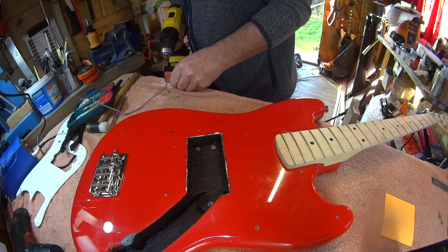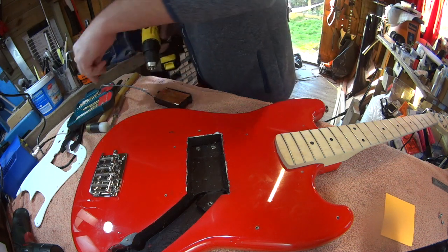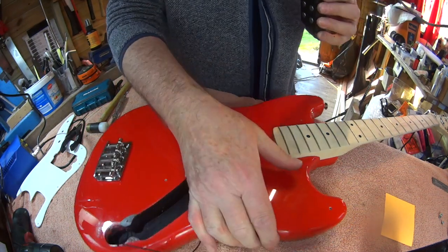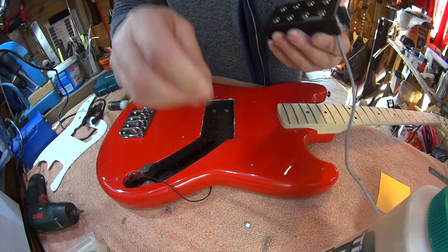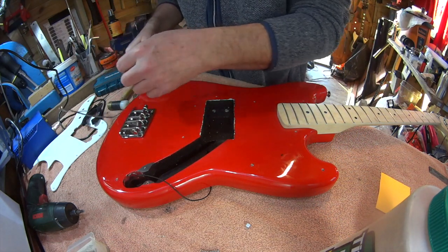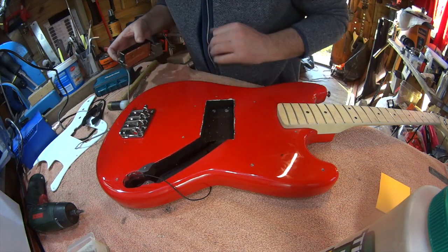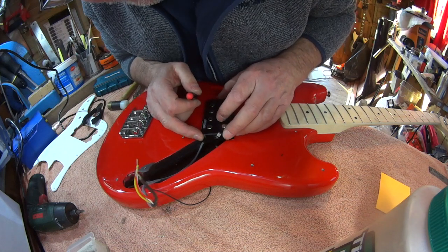Side. So this just gives you more wiggle room as the screws and the bolts go through, and the same principle occurs when I'm doing threaded inserts for the necks. When I have bolts on the necks, they are very difficult. If you make it the exact same diameter as the gauge of the bolt, then you over tighten as you're going through, and the bolt has no wiggle room, and it means you're just kind of forced into one position, and you can't adjust or get the thing to meet.